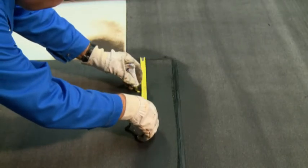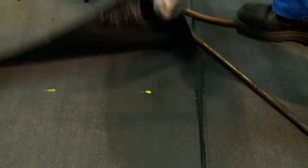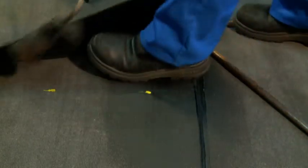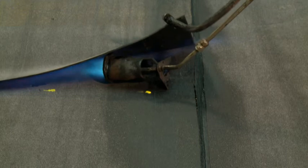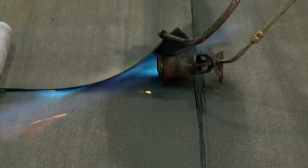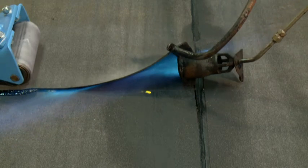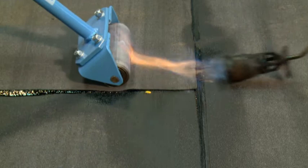The end overlaps for both Terranap TP 2 m and 4 m should be a width of 20 cm. Notice how the rolls are layered in a staggered fashion — this is to achieve a maximum of 3 overlapping joints, preventing the common problem associated with four overlaps converging at one joint.